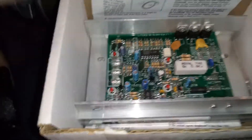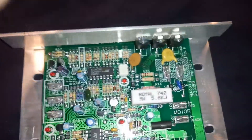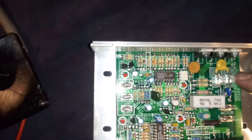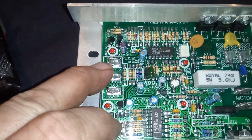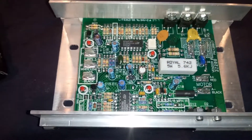The safest and most practical way to run treadmill motors is to use one of these — these are the factory treadmill boards. Essentially all you have to do: this is where your potentiometer goes, this is your AC input, and this is your motor output. So AC in, motor out, potentiometer here to control the speed — that's it.